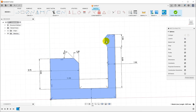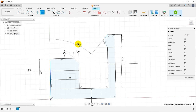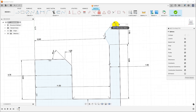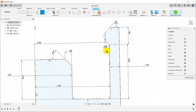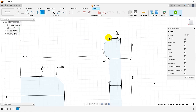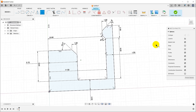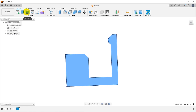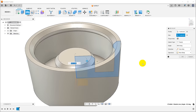I want to control the diameter of this lip, so D for dimension — I want that to be 10.9 millimeters, which is 21.8 divided by 2. Then we've got little chamfers here and I want those at 45 degrees as well. This chamfer should be one millimeter wide, and now we have the whole shape defined — everything is black, meaning we have this fully constrained. I'll click finish sketch, select that, click the revolve tool, select the axis, and now we have the solid for our cap.